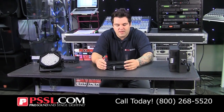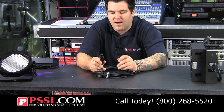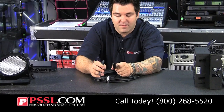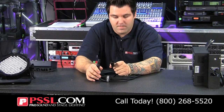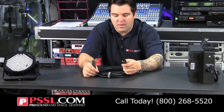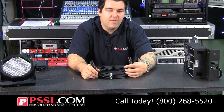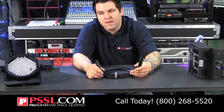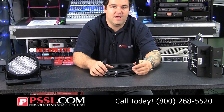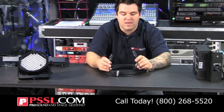The way this works: you take a DMX cable which, yes, it looks exactly like a microphone cable, but it is not. These pins do something very different — they actually have less impedance, which allows all that data to travel through the cable. Now, granted, you could use a microphone cable to run your DMX lighting. However, when you get to about the fifth or tenth light, things will start acting funny because the cables aren't designed to have that much information transferring through them. That's why you do want to stick to a DMX cable.